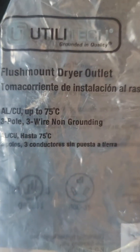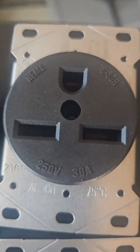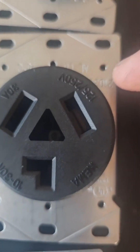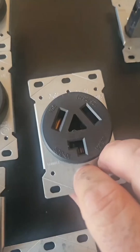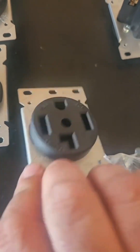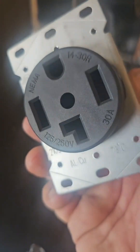First, just the packaging — the shape is called a non-grounding receptacle, and the directions that come with it call for the neutral to go on that screw. This receptacle is rated for 250 volts — it's two hots and a ground. This is what two hots and a ground look like; this is what two hots and a neutral look like. This one is rated for 125 and 250 because you can get your 120 between those two. When we flip it, the two-hot-and-ground version has two brass and a green with a bonding strap to the yoke. The two-hot-and-neutral version has two brass and a silver with no bonding strap to the yoke. On the combination receptacle, we have two brass, silver, and green, and the green has a bonding strap to the yoke — the U is the green and the silver is the bent one.